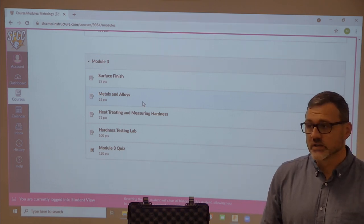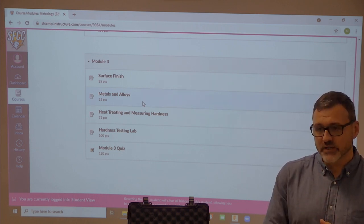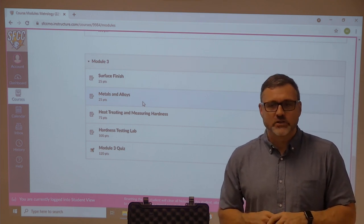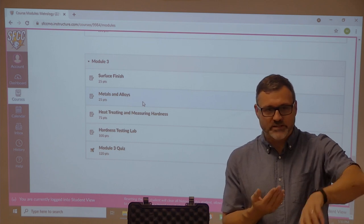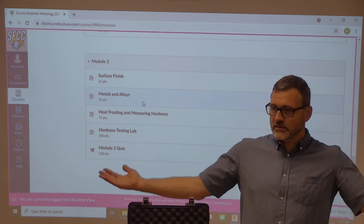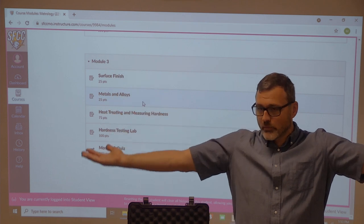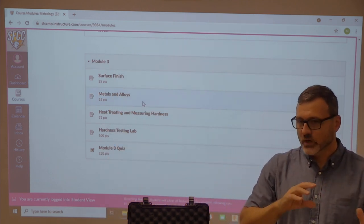It's got a grain structure. So you want to make sure that you're paying attention to how that goes, because metal will do that same thing. When you guys get out on the mill, especially on the mill, you'll have a tendency to want to put a part in, quickly fly cut one side of it, flip it over, and take all the material off the other side. That is a terrible way to go. That leans into the opportunity of it bowing up or bowing down. So take even amounts off of everything, rough, then finish.